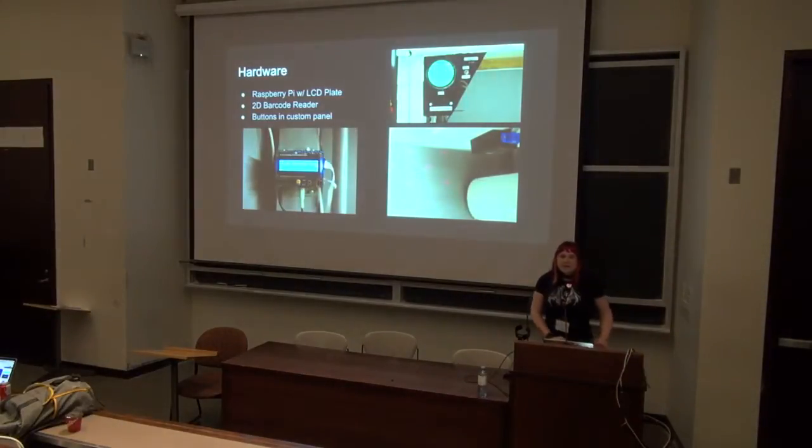Hardware-wise, I used Raspberry Pi — if you haven't used it before, it's a little circuit board, maybe this big. They're like $30, they run Linux, and you can do a lot of cool real-world applications with them. There's a barcode reader attached to it to actually read the programs. The processes are all stored on sheets of paper in the darkroom with all the instructions — which chemical goes in, at what temperature, for how long. I ended up using a 2D barcode printed on that sheet to store the whole program, so you don't have to store them in the timer. You just print them on a piece of paper, show it to the reader, and it knows all of the steps.